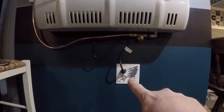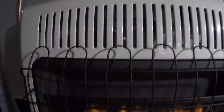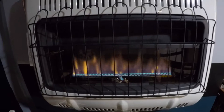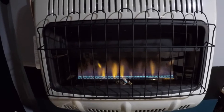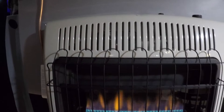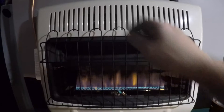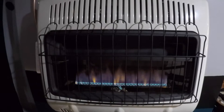We are all connected back up, fan's all plugged in. I'm going to go turn my gas back on and get this thing going. I'm going to go ahead and light my pilot, turn this on. It is on and going, and I'm just waiting to see how long it takes for this fan to start blowing. There it went — it is blowing, actually feel the hot air coming out of it. It took about three minutes for it to turn on and start running, but it is now running.